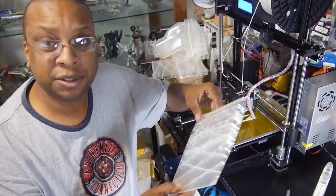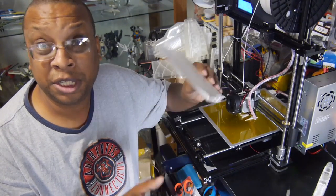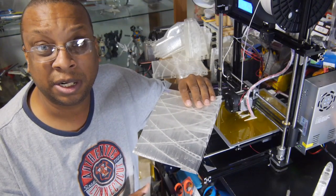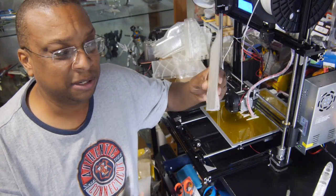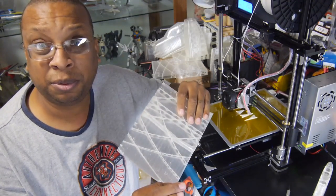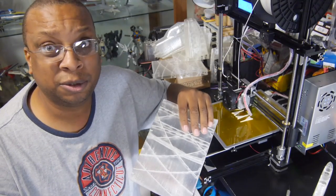So I think we're getting closer. The pieces I printed are certainly workable and I will use them. I'll just continue to tweak as I print other pieces and see what I can improve. What I might ultimately end up doing is simply printing with a wider brim — that gives a larger footprint to stick, and I'll just trim off the excess when I'm done. That will probably be the ultimate solution.